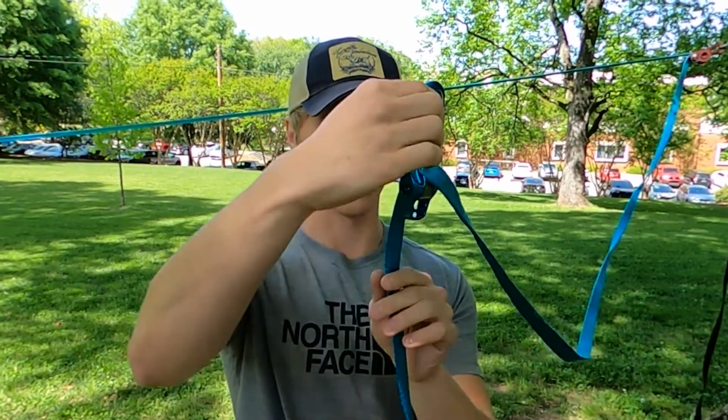Hi, today we're going to be talking about the various mechanical advantages of pulley systems using the key equation of work, which is force times distance. Today we're going to be using a lot of pulleys, so what we need to understand is what a pulley is. A pulley is a simple machine that simply redirects the force. So today we're going to be doing a 3-to-1 pulley system and a 9-to-1 pulley system and compare the forces.